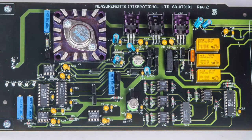Alright, and the whole board is actually not that complex, it's a two-layer board, so we can see the big TO3 package. This is actually an opamp, it's Apex PA07, high current, high voltage opamp. Very nice and very expensive op-amp. It's around $130 on Mouser. And there are a bunch of other foil resistors. You can see all these black square bodies. Those are foil precision resistors.